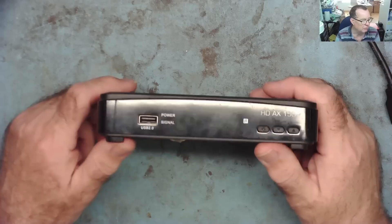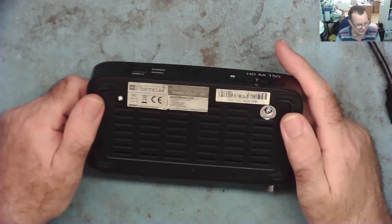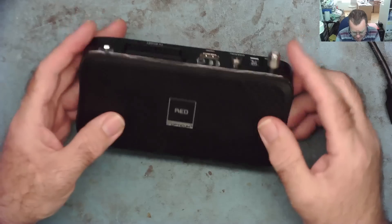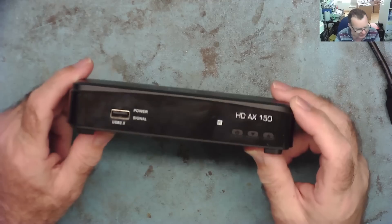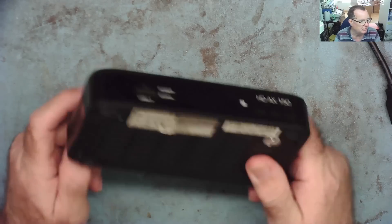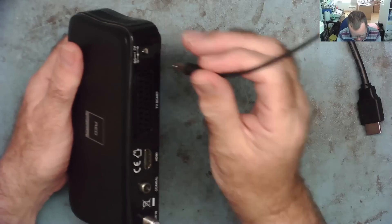For some strange reason, unlike all the other European countries like Germany, France and Italy, who put their free-to-air channels on satellites that can be received all over Europe so all their citizens or language speakers elsewhere can watch them - in the UK they stick them on a satellite where you can't receive the things once you're outside the UK, even though they're free. So lots of bars have these boxes because they can receive the same channels from another satellite, not the 28 East which is the Sky UK. These receive a satellite at 27.5 degrees west that has all the main English free-to-air channels on, with no subscription because they're free channels anyway, but we need a special receiver to receive them - hence this thing.